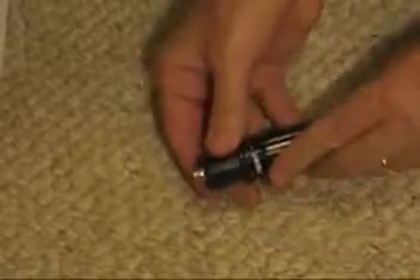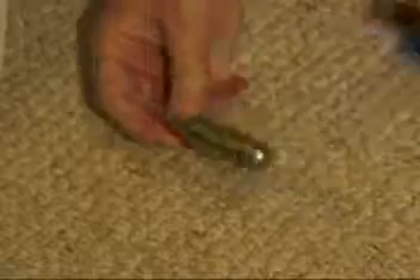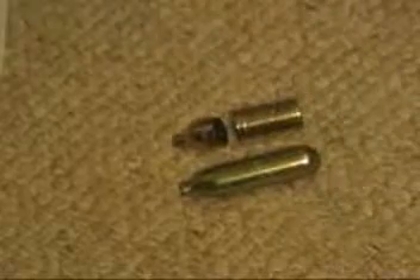There's the draft unit and this is the 16 gram that comes with it — this is an empty one. Of course you wouldn't want to do this on a full one. I have this tubing cutter — you can get them for pretty cheap, like five bucks at Harbor Freight. The way it works is you keep tightening it down and wrapping it around; it has a cutting wheel that can cut the empty cartridge.